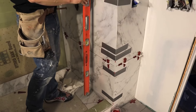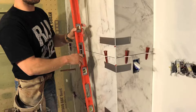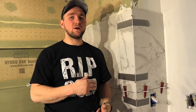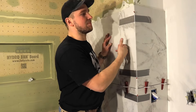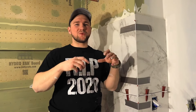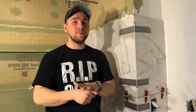This has to be perfectly level because we're putting a shower door on here — perfectly flat and perfectly plumb. Any time we're doing miters inside a shower, we're charging $35 a square foot for all our shower walls. It's really not that hard — you just have to figure out your touch with your grinder, and the more you do it the better you get. With bigger tiles it's a little harder; once you get to 12-by-24 it's easy. I'm going to make a battle video between Schluter edges and miter edges, so subscribe and hit the notification bell. Thanks guys!